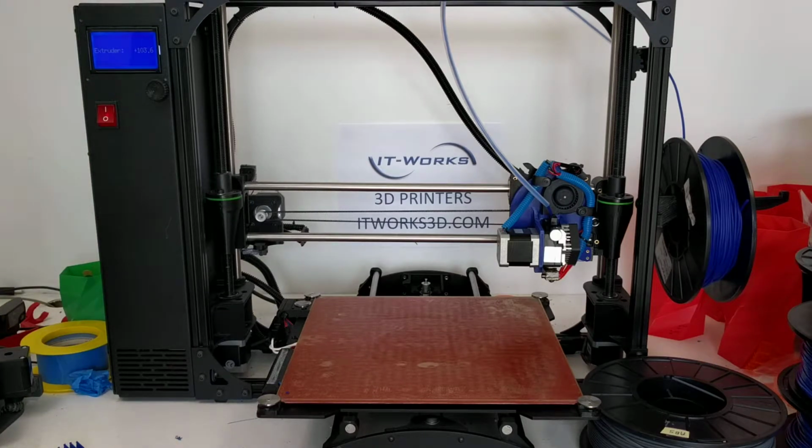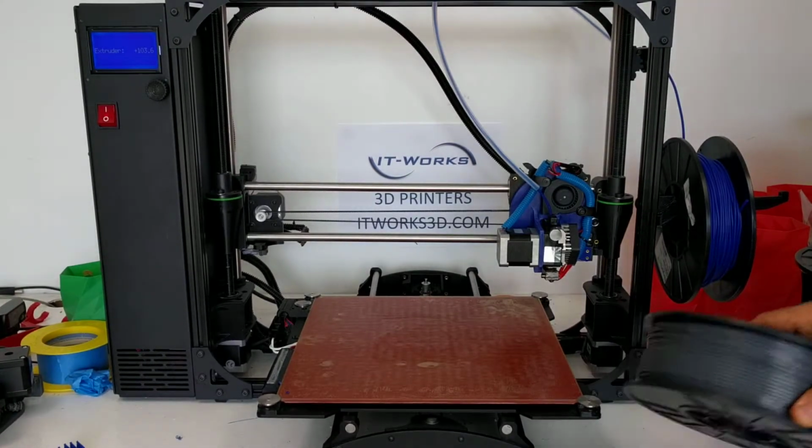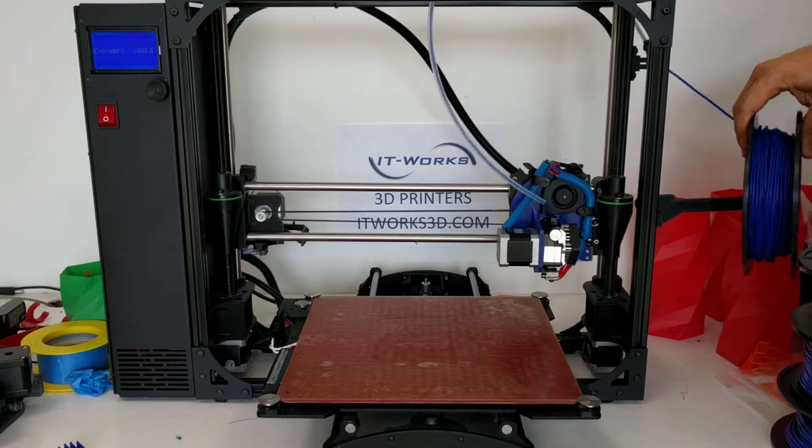The reason you want to do that is, like with the Lulzbot TAZ tool heads, you can manually bring the filament back out, just kind of pop the idler open and pull it out of there. But with this more tightly controlled filament path, it really helps to let the tool head extract the filament for you. Not the fastest thing in the world, but it does get the job done. Well, that's extracting. I'm going to go ahead and take my NinjaFlex off the spool arm here.